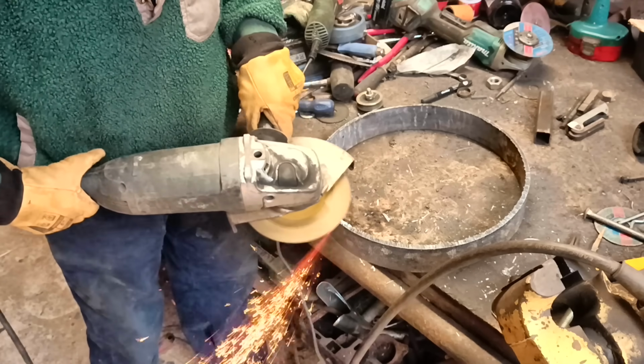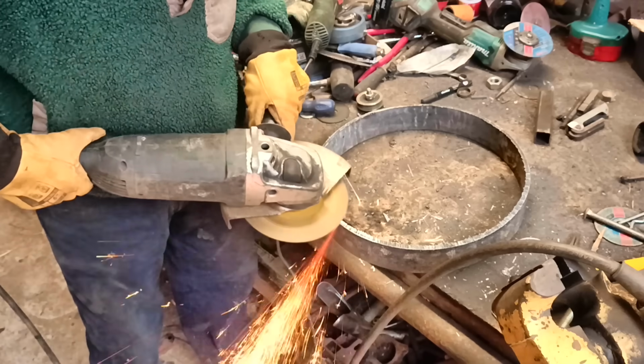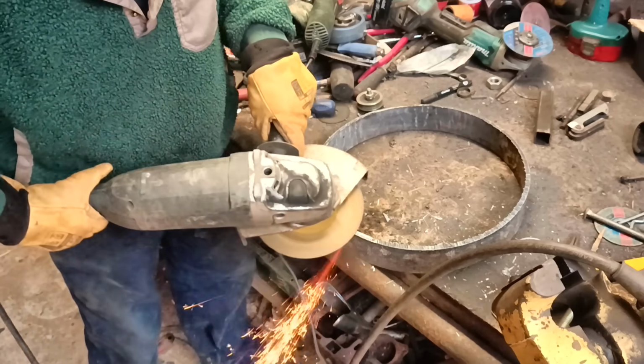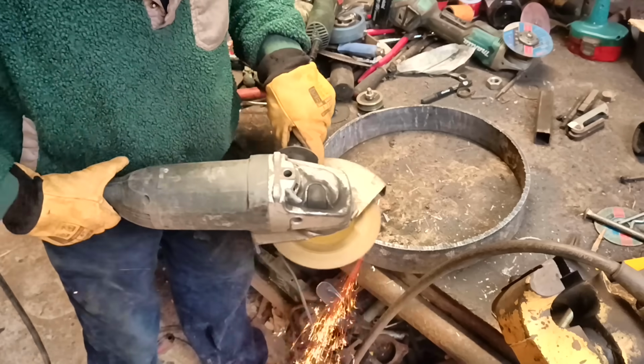Actually, I think some of the messiness of the cut is caused by rust in the bearings of the Lazy Susan, because there's a roughness in its rotation, which means a wobble in the pipe. That makes sense? Yeah. Wobbly bearings makes wobbly pipe.